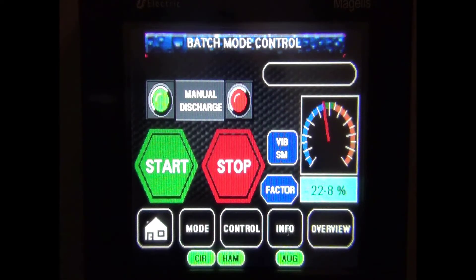Adjustments of less than 10 factor points may be desirable. Your brine maker is now calibrated. Calibration must be completed on initial setup. Salt quality and water supply can affect the measurement of salinity, so it is recommended to verify calibration of the brine maker when any of these variables change.